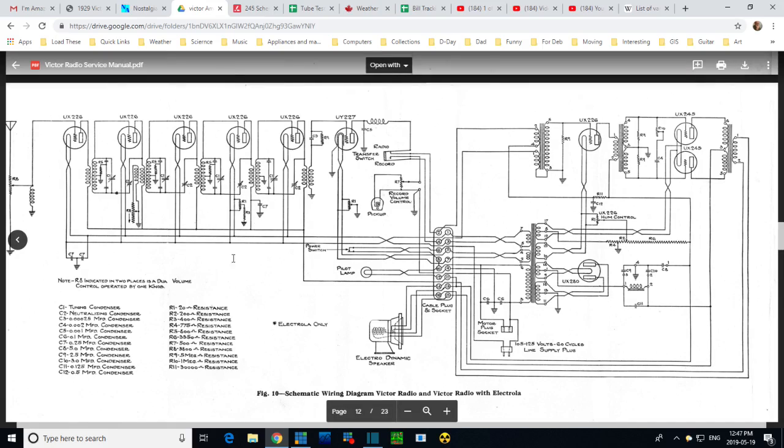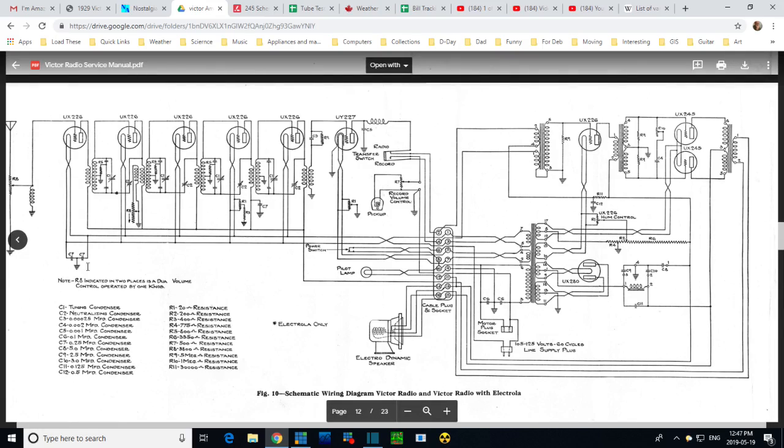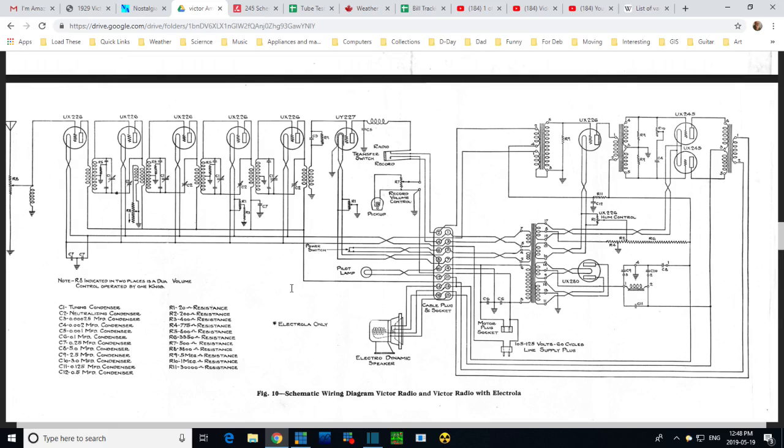Let's just look at the other ones here. R1, R3, R120, R3, 400. Yeah, see, that's tied to the heater line here. That's a way to apply a chassis ground in a balanced manner, if I could use that word. This little deal here is part of all the heater circuits. And look, here's another one down here. It's a filter technique. Again, they're doing it off of each heater leg, 2 capacitors, and then a ground. That's to balance everything. I guess that's the best word I can use for it. What other tricky things are going on in here that I got to become aware of?